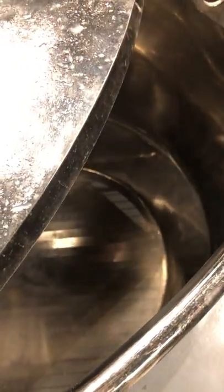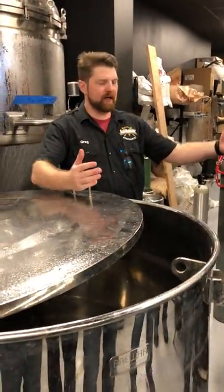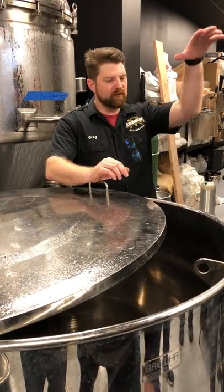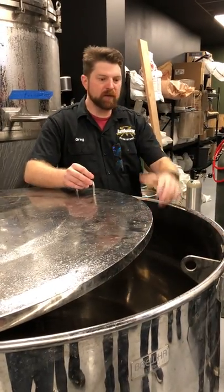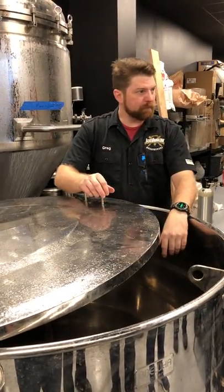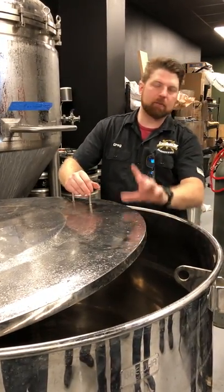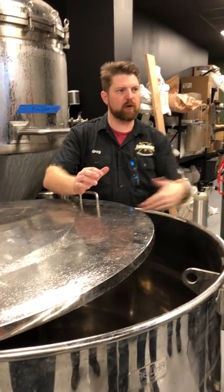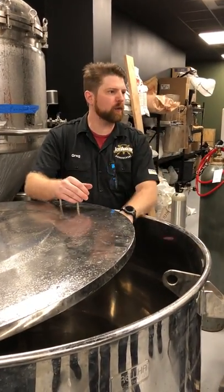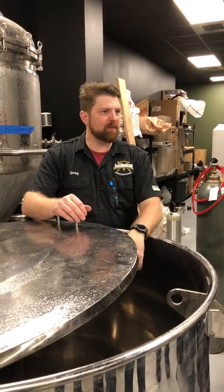So you'll notice there's a welded mesh bottom in this vessel. So instead of a traditional mash tun, in which you have a vessel that has a flat bottom with a false bottom on top of it to drain the wort out and transfer it into the boil kettle — we mash directly into the vessel that we're boiling in. This drops right in the top. With the gantry, we can pull the lid off, drop this in place, and when we lauter, we don't move the wort off the grain — we pull the grain out. We just lift it straight up, wort drains out of the bottom, and then we go right to boil in that same vessel.